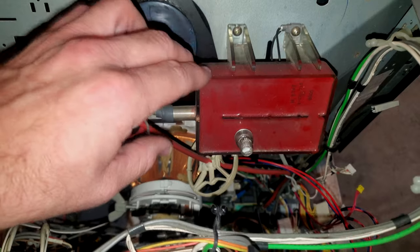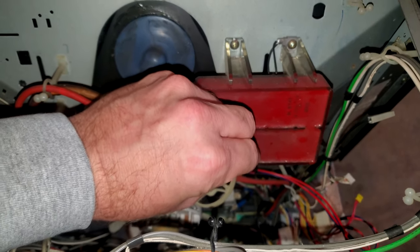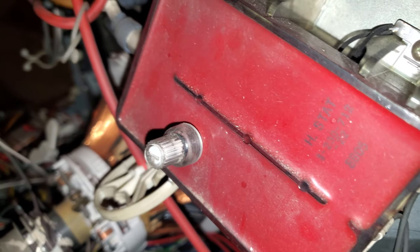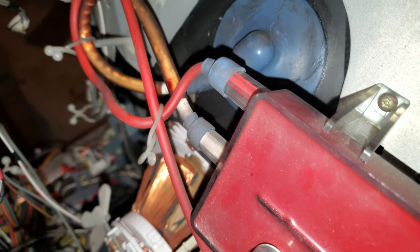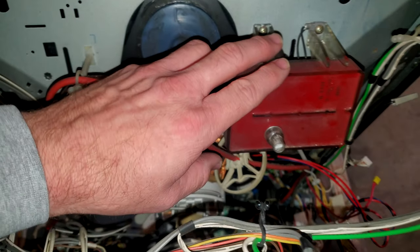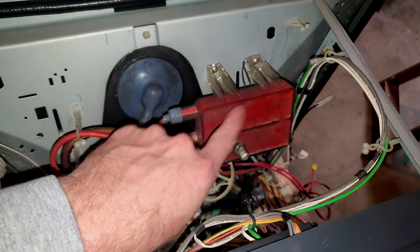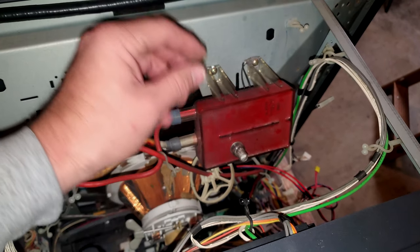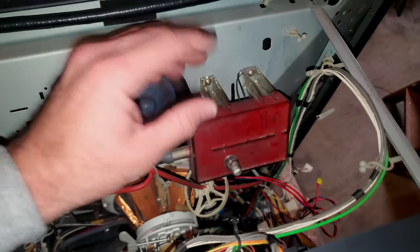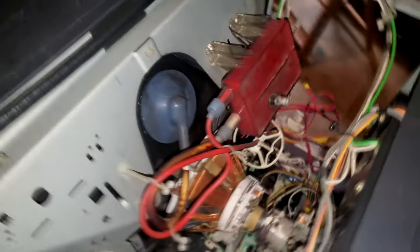This is not normally like this on the other 30 series. They don't have this potentiometer that controls H-stat. What ends up happening is over time you get shorts inside this thing, and that just pretty much makes the part useless. It has to be replaced, and it's very hard to find replacements of this. So you can have the entire monitor be pretty much useless if this H-stat goes out, and the way it goes out is the picture just starts to shrivel and shrink, and then it ultimately just shorts out completely after it's turned on for a minute.